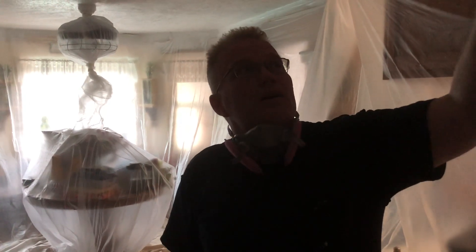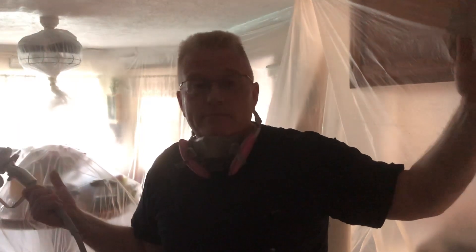If you try to roll this, you most likely pull the ceiling down. If you're rolling paint on popcorn or a texture like this, you really don't know what you're getting into until you start rolling it. Once you start rolling and it comes down, stop — because you're better off fixing that with an oil-based primer. It acts like a glue and then you can do a repair. It looks a lot better than pulling down the ceiling trying to match it all over the place. If it starts coming down with a roller, just stop right there, go to a sprayer, and do the minor repair where you pull it down.